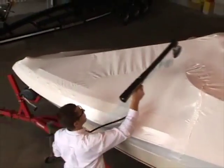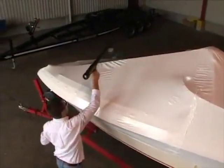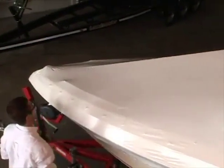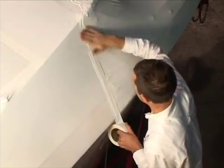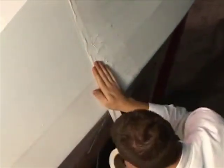Ryan has gone all the way around the boat up to the edge of the combing and now we can do the top. You can see the center support strap and where we've also put in the wooden uprights. You want to shrink it section by section — the shrink wrap will actually stop shrinking at the strapping going down the center and across the unit. Ryan is also taping the seams and pleats so that they don't come open. Occasionally there's not enough heat put in to make a good heat weld and they will come open after a few days, but a simple strip of tape will keep them closed for the entire storage season. Thanks for following along while we install the professional and durable shrink wrap cover.